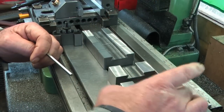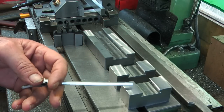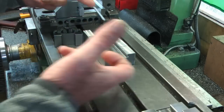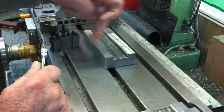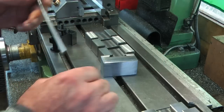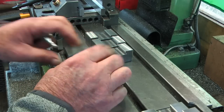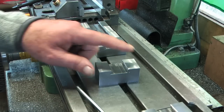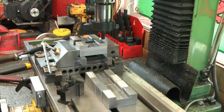As we left off in the last episode, I just cut these two off when it was the full section - these are going to be for a boring bar holder and a drill chuck. I then machined it down to minimise the material back to size, which made it easier when I had to hacksaw three cuts to make four blocks. I've hacksawed them off, squared them all up, and chamfered all these blocks on all their edges all the way around. I need to run the chamfer cutter around all the outsides of these two now.